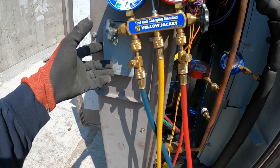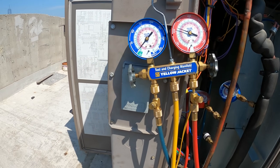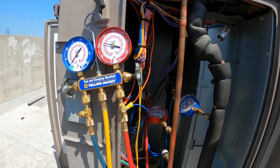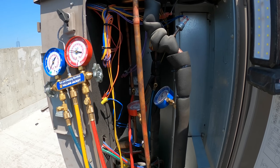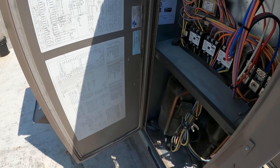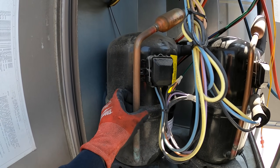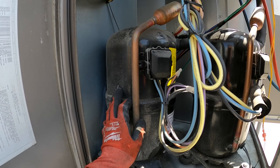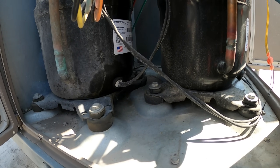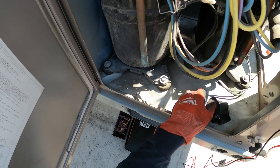Got the tank disconnected with both valves cracked off the back seat — releasing the nitrogen. We don't want the pressure switch to close with nitrogen in the system when we test it, because if the compressor starts with nitrogen inside, that compressor is going to fail. The last thing we can do for circuit two is check the compressor and make sure it didn't fail.